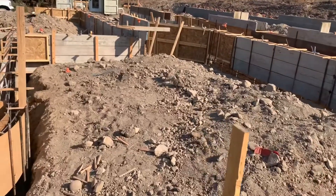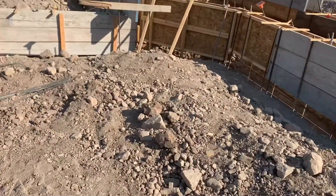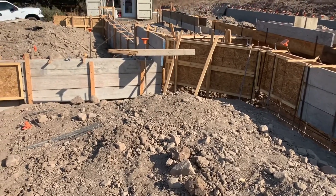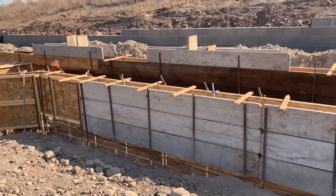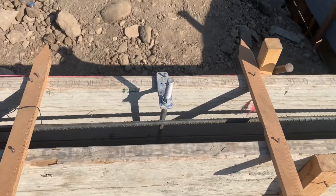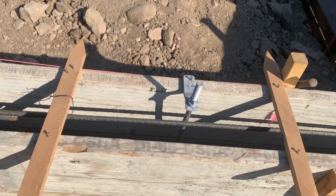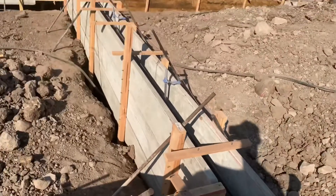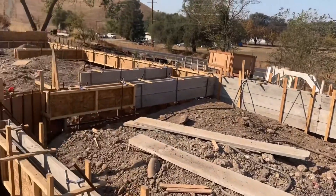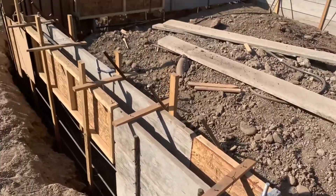The main drainage pipe will come all the way over to that corner where the kitchen sink is. Roughly in the middle there'll be an island with a sink as well, so it'll serve both, then vent out through this wall. We've got all our anchor bolts in — plans call for half-inch but I used 5/8s. Each goes down past the rebar so they're locked together, every six feet on center and one foot from every corner — about 100 of them in the whole house.